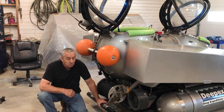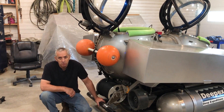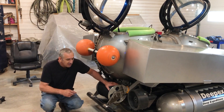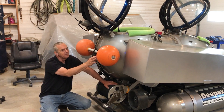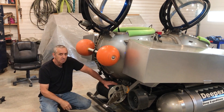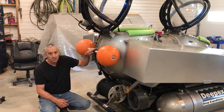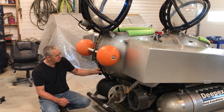Another thing I've done — which I'll do from now on on any submarine I own, regardless of how deep it dives — is equip them with a recovery line. This is a spool of 500 feet right here. The line is half-inch braided nylon and it can lift 3,700 pounds. I use two floats to compensate for the weight of the whole system and to ensure the rope is towed to the surface, because this rope is not buoyant — very close, but not buoyant.